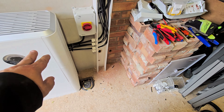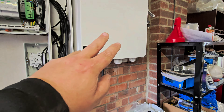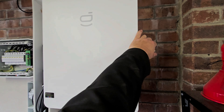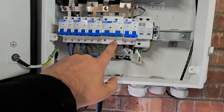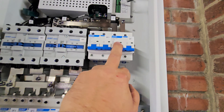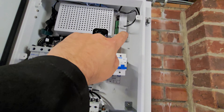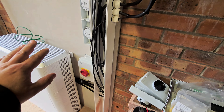We've got all our cables running low level out to the inverter through this AC isolator, which jumps up into the gateway. This is the energy gateway — I really like the box on these, it looks really nice, it's a more aesthetically pleasing gateway than others on the market. Inside, you've basically got three inverter inputs, your consumer unit connection point, and the SPD. Up here we've got our grid input, and then this is if you've got a generator — so a backup diesel Jenny or something. All we've really got out of the top is the LAN port, which runs off down to the SIG Energy inverter.